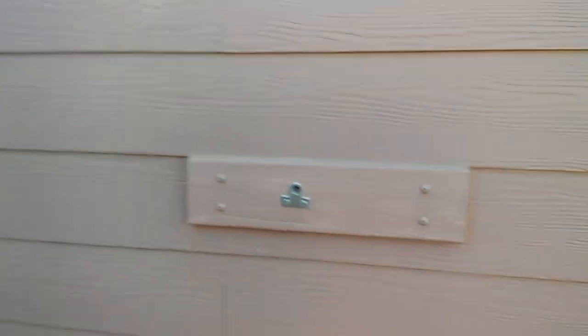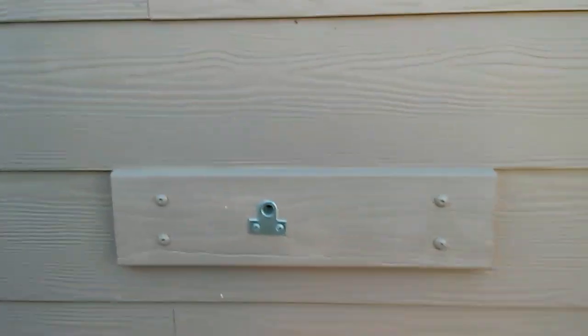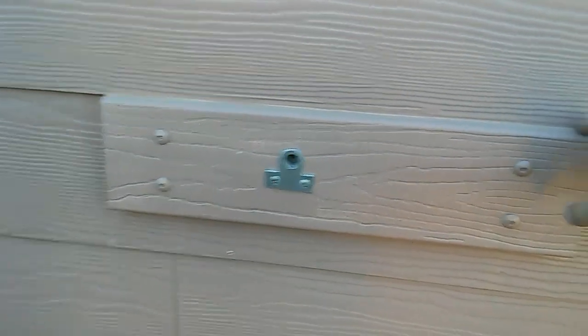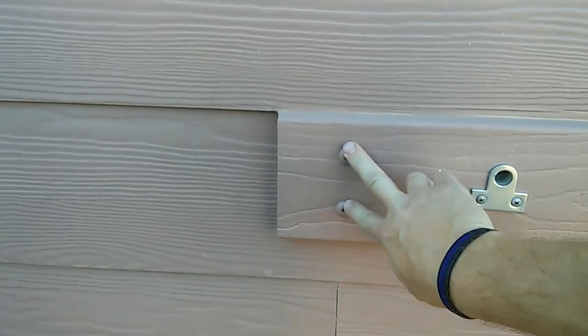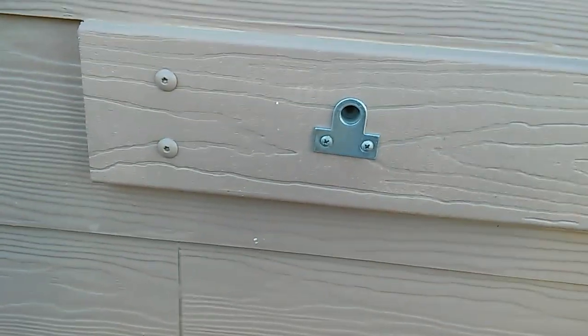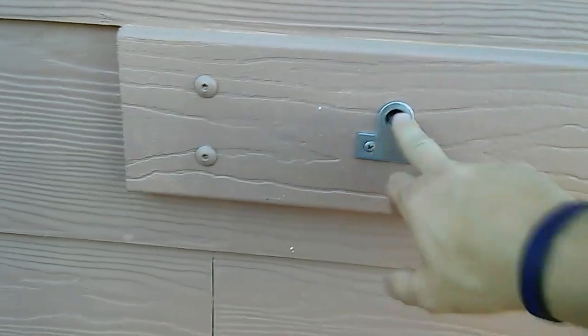The other hard part was how I was gonna lock it into my home — the other side of this wall is my garage. I found the studs on each side on the fabricated wood decking, bolted that end to my two-by-fours after I marked them, and put in a sliding latch so it locks and can't swing back and forth.